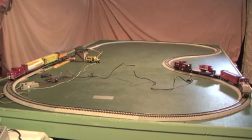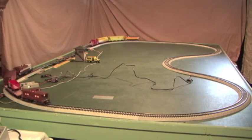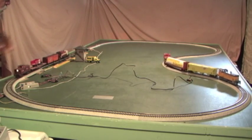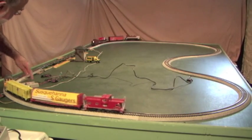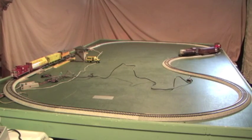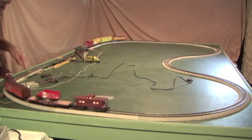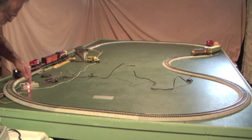I've reduced the lights a bit so you can see the LEDs better. Notice it's green as the train comes into the block. When it reaches the deceleration point it goes to flashing red, meaning it's decelerating. Now it's waiting. There — the second train went over the acceleration reed switch. Notice it's blinking green, meaning accelerating. Now it's solid green waiting for the train to come into the block. Flashing red for deceleration, then stop and pause. There it goes back to blinking green as soon as that train goes over the acceleration reed switch. The red LED on your right triggers just when a reed switch is activated.